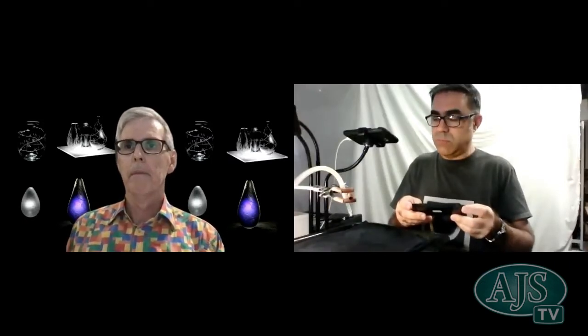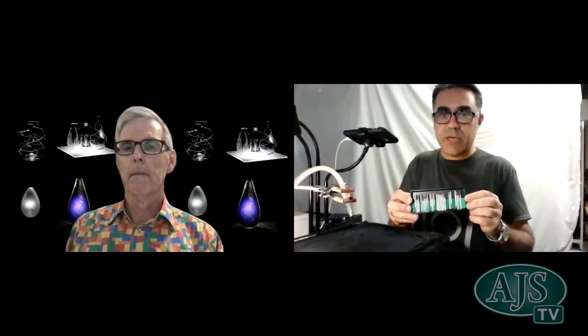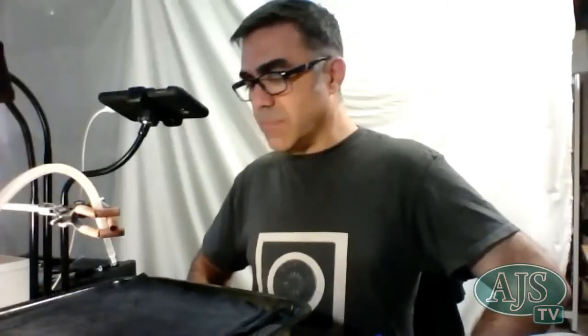and they are quite readily available, again from AJS, and inexpensive, and they give you an opportunity to just experiment with some different profiles. They come with different diamond sizes, so the diamonds can give you a rougher cut or a finer cut, which is something you might look at if you're given the option. They can also be sintered or coated, so there are different price ranges, depending on whether the diamonds go all the way through the material or are just on the surface. I use just the coated ones a lot of the time.